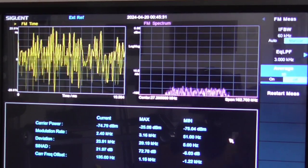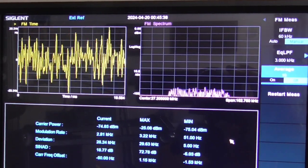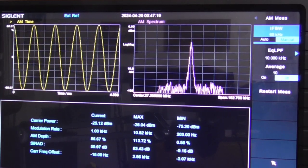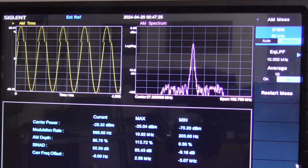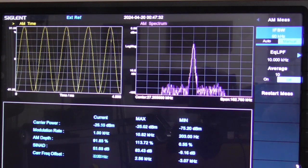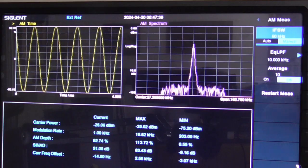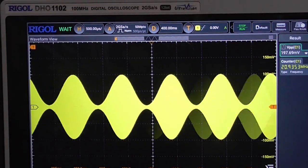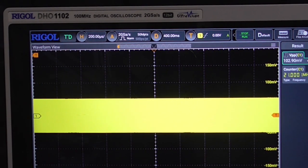I'm going to pause it now, come back and show you the AM and stuff, then do a couple more tests and show you the power output. Right now I'm measuring AM modulation — depth is 86%, this is the low power modulation. I don't really trust this device for measuring modulation; I prefer an oscilloscope. You're looking at AM, you should always have an oscilloscope. So that's where we are — let's make sure things lined up good.